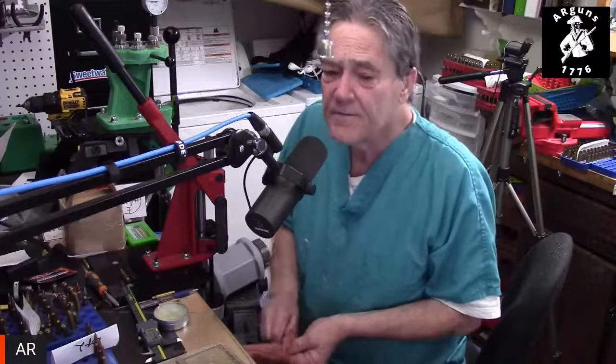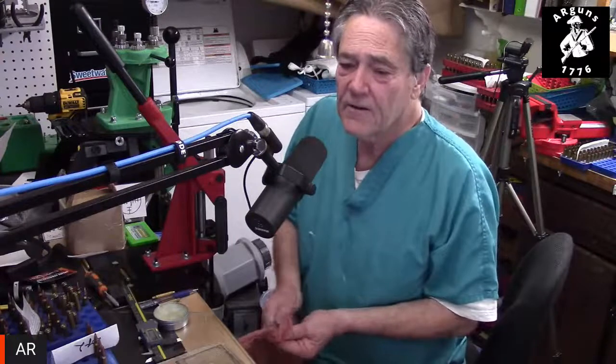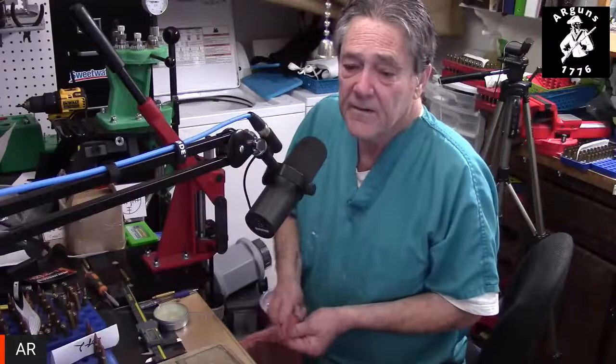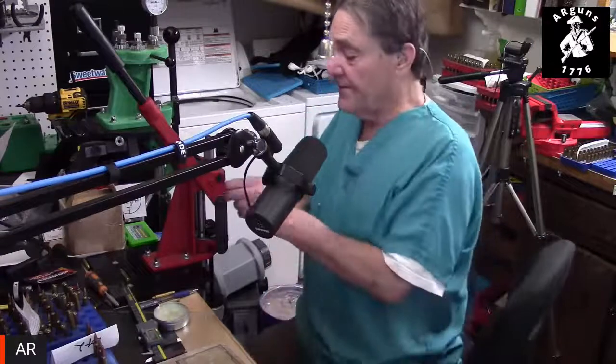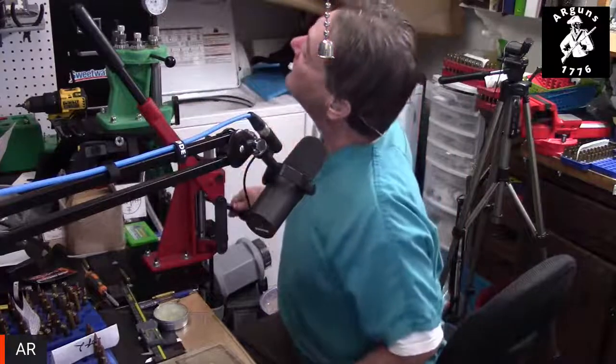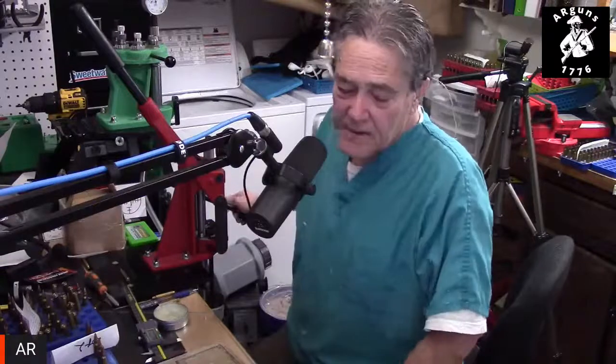Nope, sure didn't. As I'm turning, I can tell it has not hit the shoulder. I don't know all presses, but my Forster, I can tell. It's not hitting the shoulder at all. Yep. One thou over. I can leave that alone. That would be basically shoulder bump.